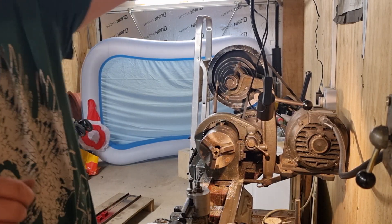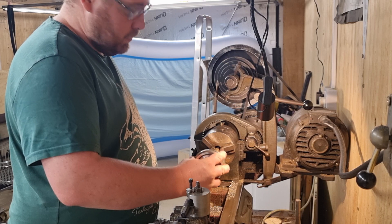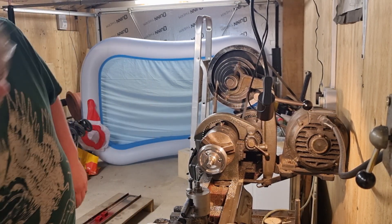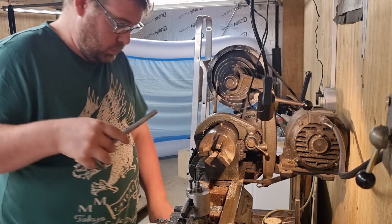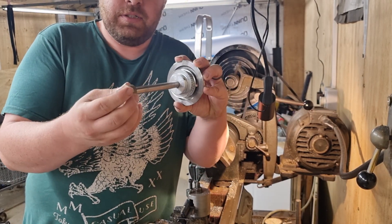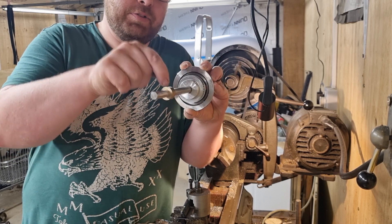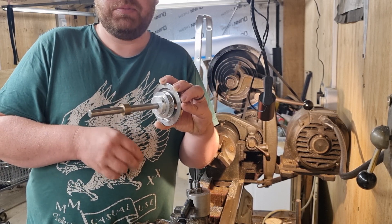We shall see if this fits in - it should do. Oh yes, lovely! We'll have it out now because that's done. There we are, that's nicely machined. Off camera I'll take all these burrs off so it's not sharp. That's a nice fit, and all I need now is just a grub screw straight through there - drill and tap it, glue the wheel back on, jobs are good and we can put it back together.